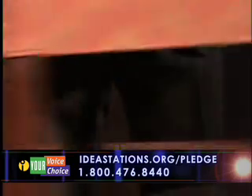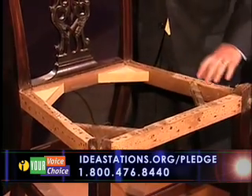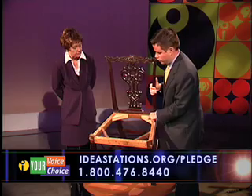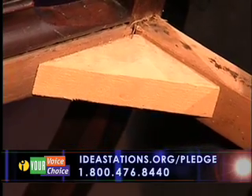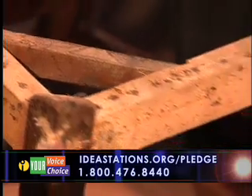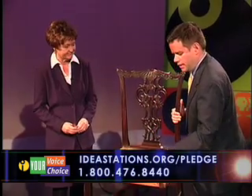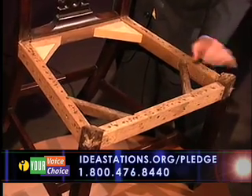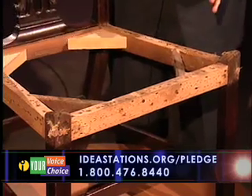After you've done that, you have to actually not have the upholstery on the chair. I brought in one that I haven't put the upholstery back on so you can see. If it's being sold, you ask permission, remove the black fabric off the bottom, and then you look. In this case you can see there's some glue blocking here — these look new because they are newer, and then down here these look old because they are older. In an 18th century chair they blocked differently than they did in a 19th century chair or as we do today. This blocking is a lot stronger than what they did early, but this is what you want to see — when you see these you get really excited. There is one other type of blocking that can be like a half circle and it'll be really small as well. In a large set of chairs you have a good chance of finding a lot of these, but if it's only one or two chairs it's very easy to have all the blocking replaced.